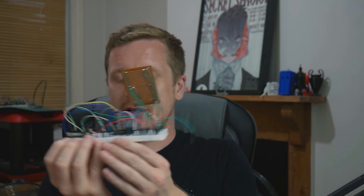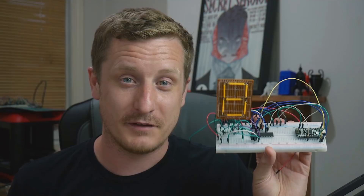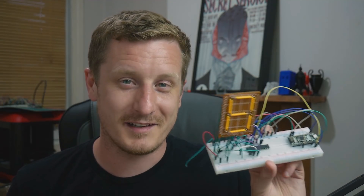I've also made a mini breadboard prototype — some wires flying about. Obviously you've lit one of these up before, but I'm using a different IC this time. Before, what I was going to use was two 74HC595s to drive it — that would have worked fine, it would have given me 16 outputs.